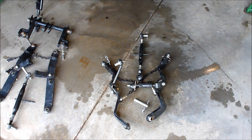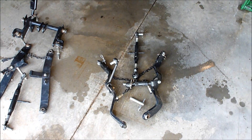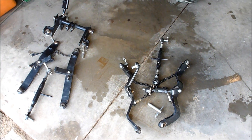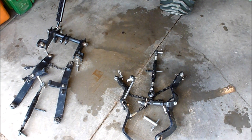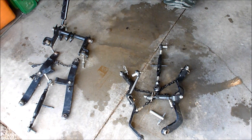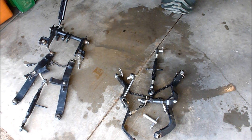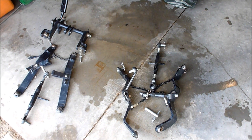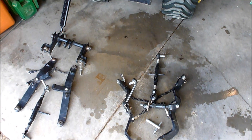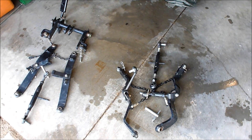When the X5 — what I'll call the 4-5, 5-5 units — first came out, they came with rock shafts, and they were still using the 4-5 series, so that would be the 4-25, 4-45, 4-55, and they were still using a lot of Category 0 implements. That's why you have the option of either Category 0 or Category 1 Limited.